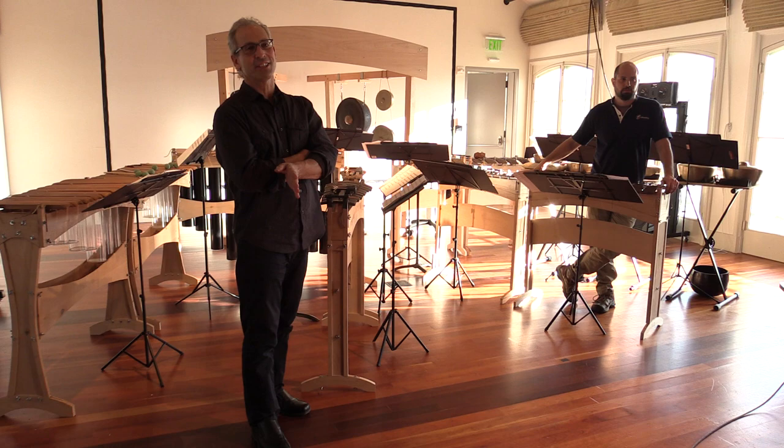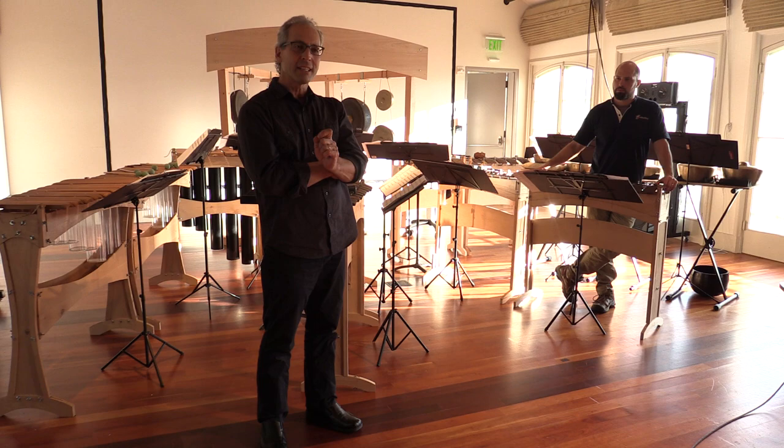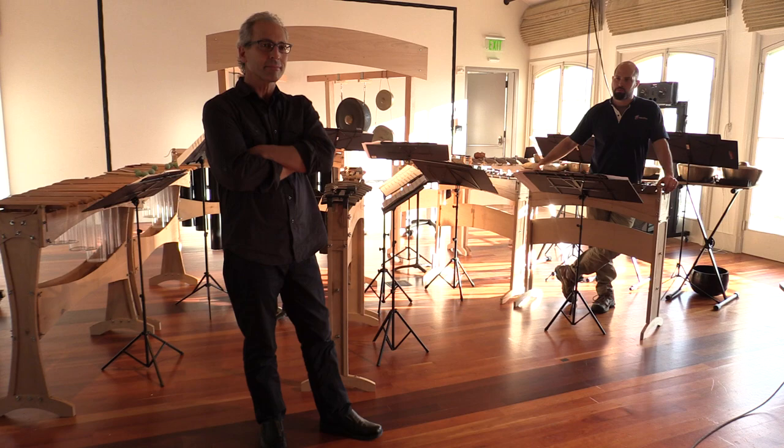With one exception, they have an acetylene torch nearby, and it used to be if they missed and you put a hole in it, you're hosed. You had to start over. You just had to quench it, break it into pieces, throw it back in, and start all over again. But now with the acetylene torch, if it's still hot, they can repair that one spot and hammer over it, and it'll come out okay. But aside from that, it's still the same process they've been using.